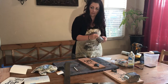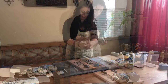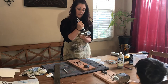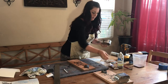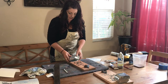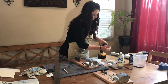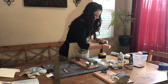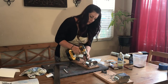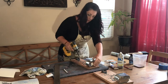Next is our tin. I'm going to place a little bit of silicone right where I'm going to put that screw to give it some extra adhesion. Eyeball it, press it in place, then switch my drill bit out — this is where my half-inch galvanized screw comes in. Put it right in the middle, eyeball that too, and screw that in place.